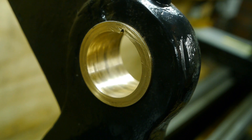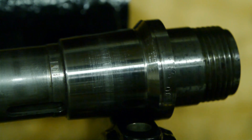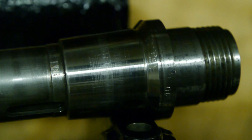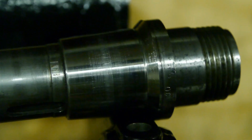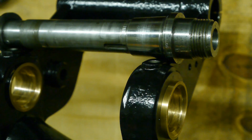Trying to take out as little material as possible, because when you take out too much the tapered bearing might seize up. I should also tell you what I did to the spindle — well, the bearing part of the spindle. The only thing I did was very lightly rub this hard stone file on here, only on the middle part which is very slightly grooved — it's hardly noticeable. I'm hoping this will help with the oil distribution. I did the same for this rear bearing — it got the same treatment as the front bearing, although it is in a better condition. So I'm keeping my fingers crossed hoping that I didn't screw things up and all this work will be for nothing.